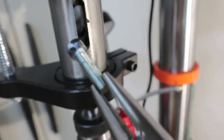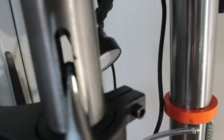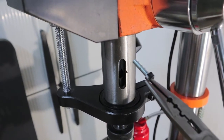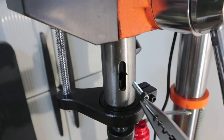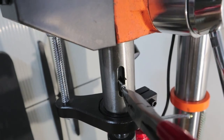So I found this: with a hex screw, I went ahead and ground two flats, one on each side. With needle-nose pliers, now you can get it through. You can imagine what's going on — we're going to stick this through the slots, both of them, through the quill and the spindle, and get it to go down through the threaded hole without damaging the threads. It's got enough clearance.